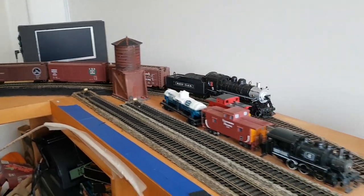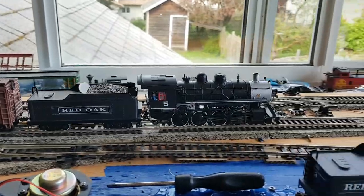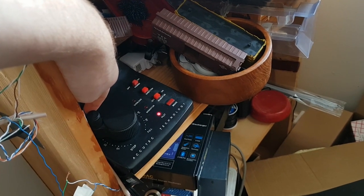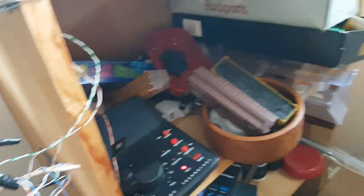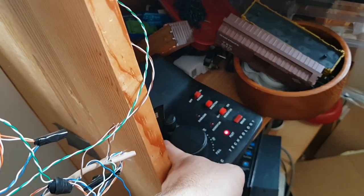One thing I am discovering is that this gets a little bit noisy when you're running it more than a crawl, so I don't know how often I'm actually going to end up using it, but it is kind of neat that it works. As you turn it down, that's about where it started moving, but the train doesn't stop until it gets to about here — at which point the pulse-width modulation is kicking in and cutting the power. So again, we should try that with a different transformer. It needs to get down to about this point to stop, but it needs to get up to about that point to start moving again.